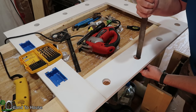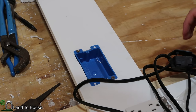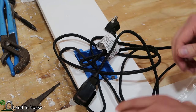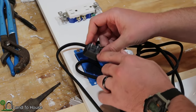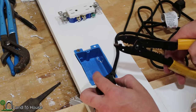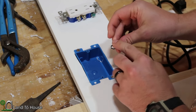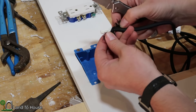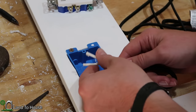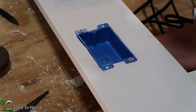I'm using a curved file to take out some of the barbs that were made when drilling these holes out. To bring power to this vanity mirror, I've purchased a nine-foot cord that has a nice fabric coating on it to make it look really cool. Sadly, it was not a grounded extension cord, but I think it's still going to be okay. I'm going to take my wire cutters, remove the plug, and strip this back to get to the wiring inside. Then I'll find the opening and feed it through the back side of the box.